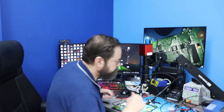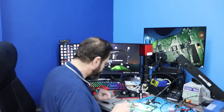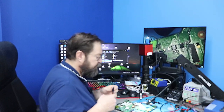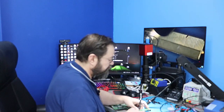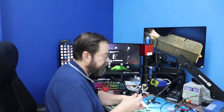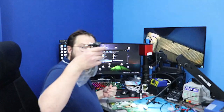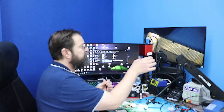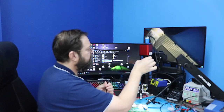It's there for a reason. So somebody's brought you in this computer and you have a bench power supply like I do here. I have it set at 19.5 volts, which is what most computers run on. And I've got a jack — I really recommend you guys go out and get a full set of assorted DC jack connectors.